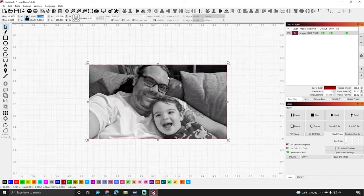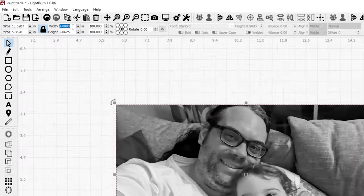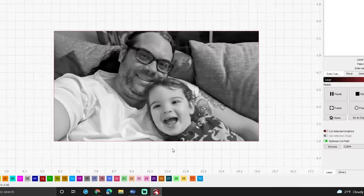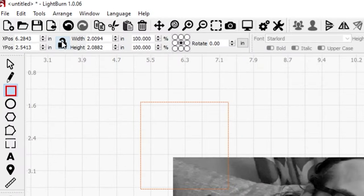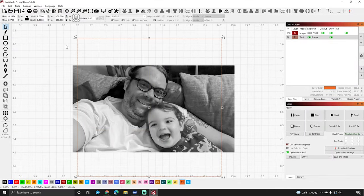The actual size I want to burn is eight by eight, so I'm going to grab a square, come to the bottom, and choose T1. This is a tool layer, not a burn layer. I'll make a square, click T1, then unlock the box and click the cursor so the square is highlighted. I want to make this eight by eight — the size of the burn — and lock it so it cannot change.